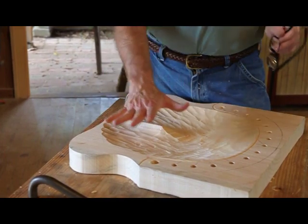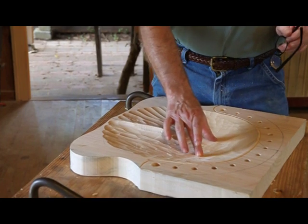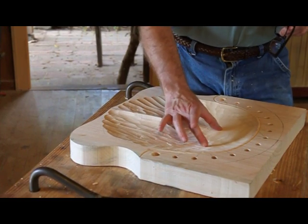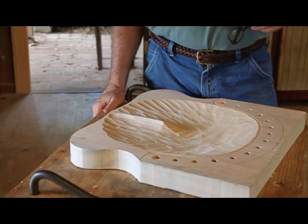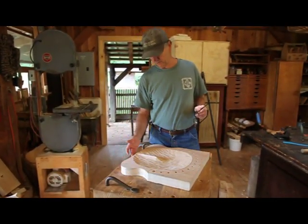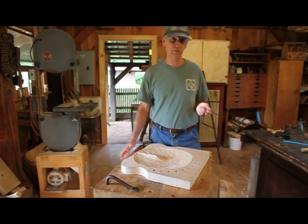I've already hogged all this material out with the adze. I've gone down an inch deep right here. Those of you that have the plans can see that the depth is three and a half inches from that gutter right there — it's an inch deep and about three and a half apart. So that's my deepest part, and then everything else comes down to there. So if you don't have the plans, now you know how to carve it. I'm going to draw this out over here on this side, but I want to go to the plans first and show you what we're talking about, and kind of translate those plans for you.